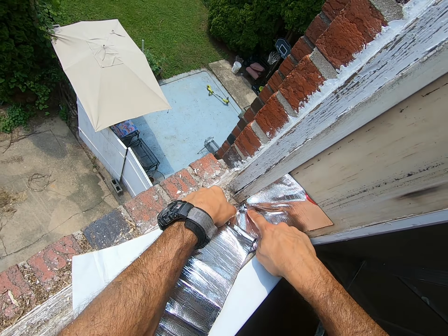We're gonna install the skirt next. Now I'm gonna show you a tip with these skirts. The end of each window loses the track right here, about a quarter inch. So what you wanna do is, make sure you don't slice your finger, cut that top portion of the track about a quarter inch back, and just bend it and cut it out. Line it up.